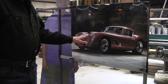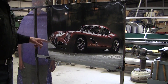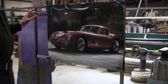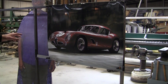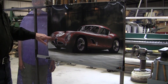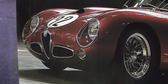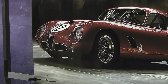When we do the headlights, we'll just come down with the aluminum skin and cut those headlights in later. Actually this body is a very rounded shape and it lends itself perfectly to the English wheel. The only real complexity I can see — most of this is really simple but it's an elegant design — is that these grills and the center grill here protrude out a little bit. They're sculpted out a little bit, which gives them nice prominence and a good look.